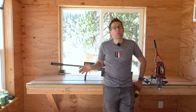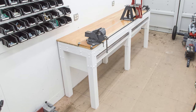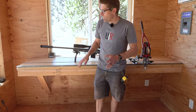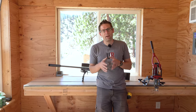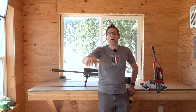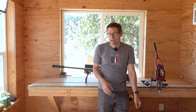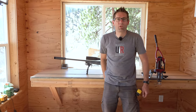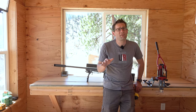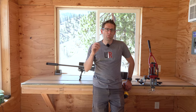The big difference with this bench compared to previous benches I've built is the fact that it does not have post legs that come down from the middle and ends of the bench to support it. This is a very space-constrained environment — 160 square feet, 10 feet wide and 16 feet long. It's got a hide-a-bed, a corporate office desk, and I'm going to use it as a guest lodge. So I had to be very conscious about how the space felt, and I used 45-degree 2x4 supports bolted onto the wood frame and wall. It's 2x6 construction with R19 wall insulation and R34 in the floor with 2x12s — very solid attachment points using the walls.